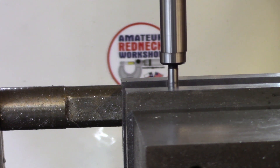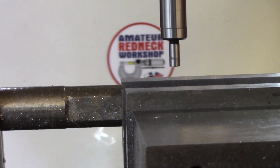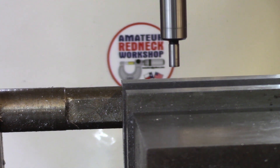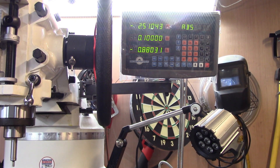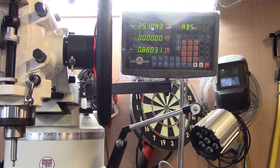What we'll do here — I know that little booger is 200 thousandths in diameter. So we'll raise him up, come forward until we get to zero, then come all the way around to 100 thousandths. I'll show you the DRO — I'm setting on 100 thousandths right there on the Y axis. Zero. Y axis absolute zero.